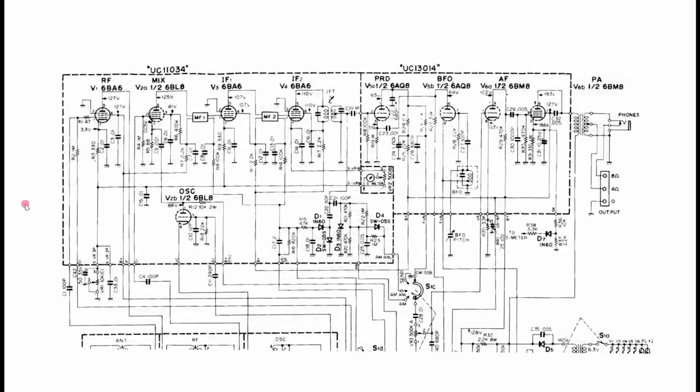These filters are very sharp — maybe a bit too sharp for double-sideband AM detection. Guys that want high fidelity are not going to be really happy with these filters, but they're great for digging out weak signals. This also hits on the winning Japanese idea of using multiple low-cost parts to approach the performance of one very high-cost part, like the Collins mechanical filter.